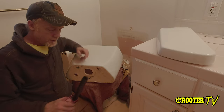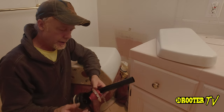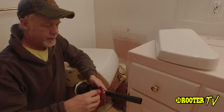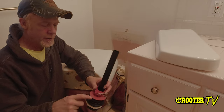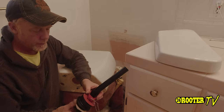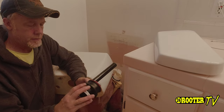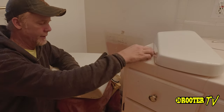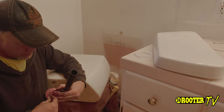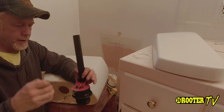The first part we start with is the flush tower. The way it comes out of the box is it has this little paper retainer to prevent the rubber in packaging from getting seated. So take that off, go ahead and remove the nut, set that aside. You want to — while it's easy to do — get your chain undone before the flapper.